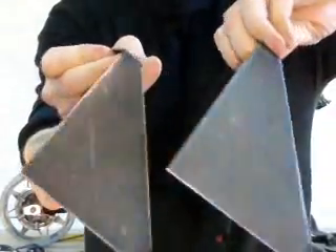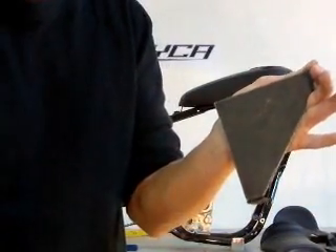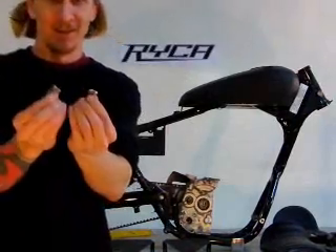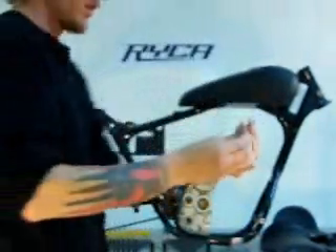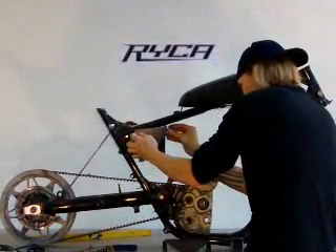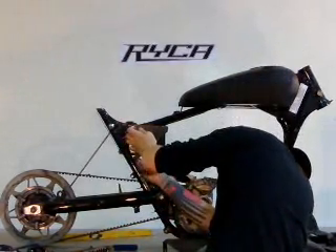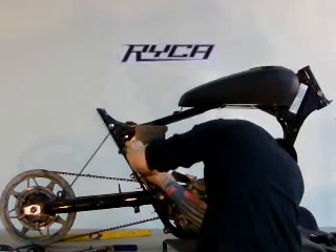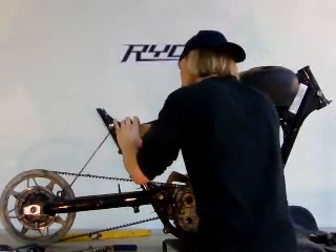Next step is mounting the side panel hardware. These metal triangle brackets attach to the front side and underside of the battery box. It's important to scuff these up with 60, 80, or 100 grit sandpaper on the front side where you'll glue the side panels. The hardware uses thumb screws — raised and knurled so you can take them on and off by hand without tools. Put the thumb screws through the front and bottom of the side panel mount. Before gluing the side panels on later, sand them with 80 or 100 grit, but don't use any cleaner or solvent — just wipe with a clean rag after sanding.